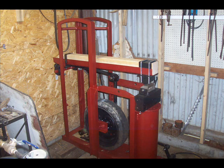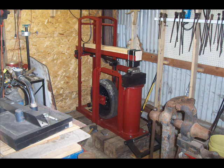So what we've got now is a working power hammer made pretty much entirely from scrap. I have tried this out and did a little bit of trial testing and it hits seriously hard — it might hammer like a 50-pound Little Giant. It might take a little bit of tuning to be completely happy with the lighter blows and controllability on single hits, but as a helve hammer I really expect it to be a drawing machine anyway.